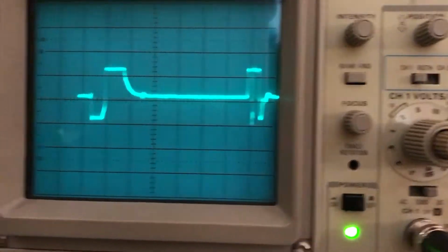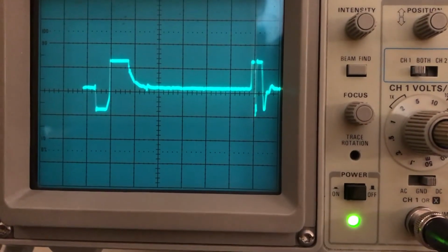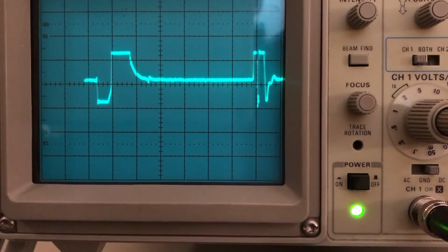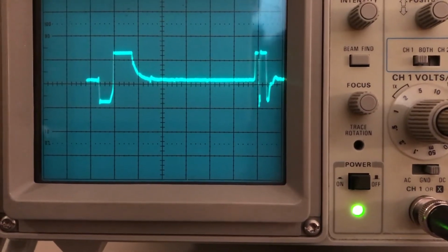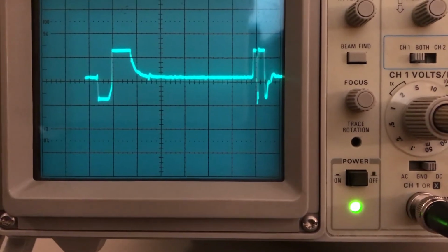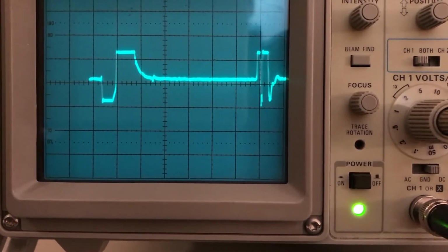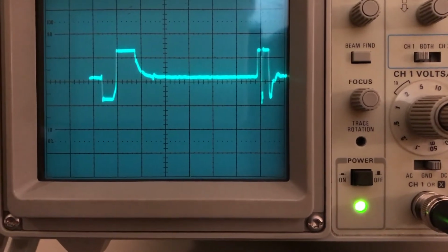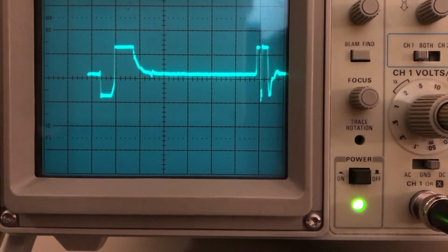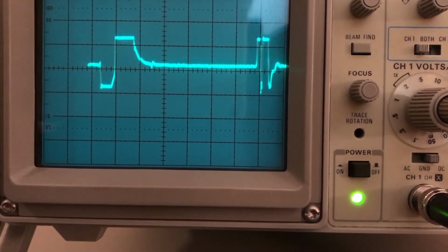Okay, now I've got the compact tension sample made out of steel under the probe. So the aluminum sample of the same geometry was giving us a back wall signal of around, say, 5.5 squares in time. And I haven't changed the horizontal time scale at all on this one. So our steel is taking a little bit longer for the sound to return to the transducer. It looks like a full, really close to a full 6 squares.